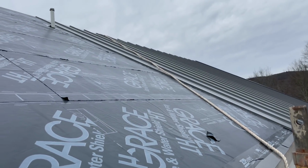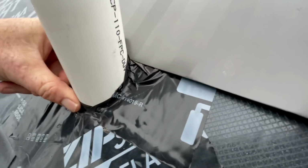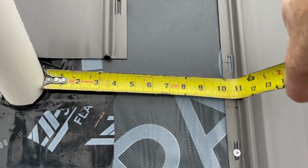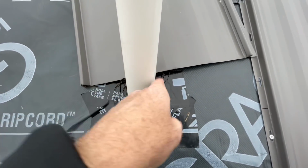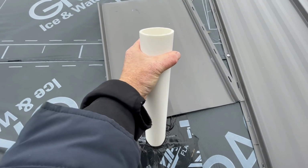Here's where we got to last time. We stopped because the next thing was to put the panel that goes around this pipe. To get this measured, I just use this scrap piece as a square coming off of this flange, because this is going to be like an oval cut since this is on an angle. I need the top and bottom measurements of the pipe from the bull nose at the bottom. I need the diameter of this pipe, which is 2 3/8 OD, and then the distance from the furthest right point of this to the inside of this. Using those, we'll cut a hole that's super tight around that. Then we'll use Lexel to seal it permanently. And then we're going to paint this pipe the same color as the roofing with some Krylon spray paint, so it kind of just disappears.